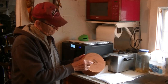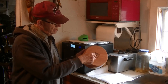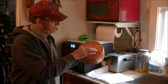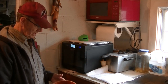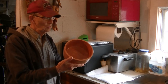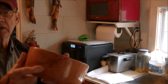It had a 100 millimeter tenon, about a quarter to three-eighths inch thick. I cut it off and put the meter right there — that made it halfway through — and I had moisture in there at about 12%. So I put it back in upside down for four hours at 95 degrees, and it now checks out at 4%. This works. There are no ifs, ands, or buts about it. It's my go-to method henceforth. Pretty bold — one of my better ones — and I wasn't even trying to make a real pretty bowl. I was trying to show you how to dry it.